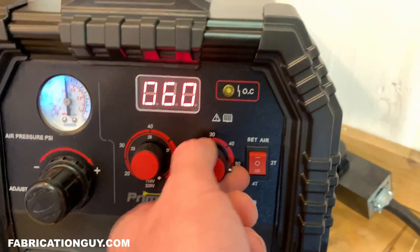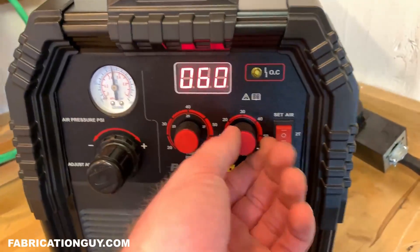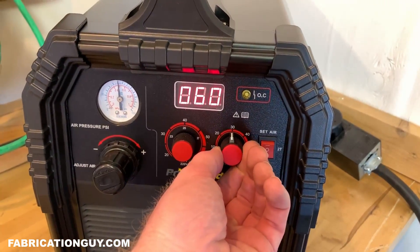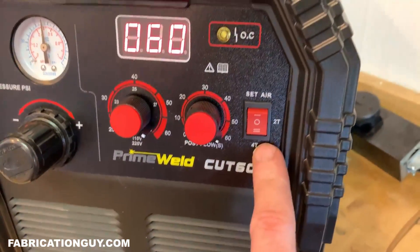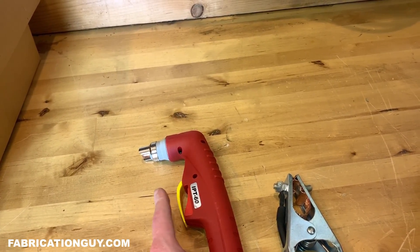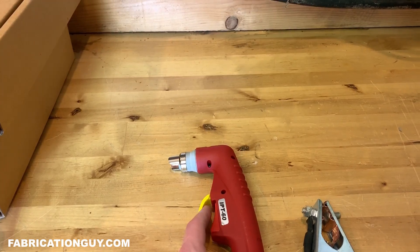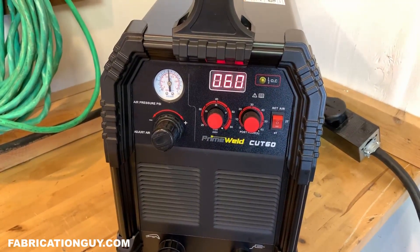This is your post airflow control. It controls the amount of time air will run after you're done cutting, to cool down the plasma torch. You can set this high to play it safe, or if you're doing smaller cuts at low amps you can turn it down to conserve air so your compressor doesn't have to cycle as much. Next we have the 2T and 4T switch. 2T is regular torch operation — press and hold the button and the torch cuts; release and it stops. In 4T mode, you press and hold to turn it on and it continues cutting even with your finger off the trigger; press again to stop. That's great for longer cuts to take stress off your hand.